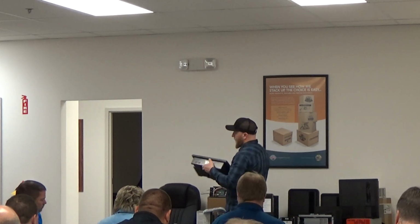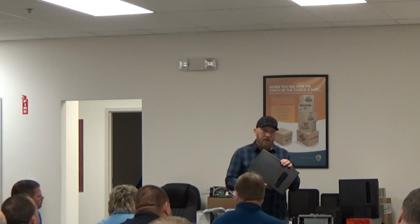On page 32 is our 893050. This is what I told you our 9800 plugs into the back of, or our 68100. Any of our deck mounts plug into this 20 amp receptacle that's on the back end of here that is pre-wired into the panel itself. I can't show you because there's a block, but all that 3050 is a distribution panel. So this only houses your breakers and fuses.